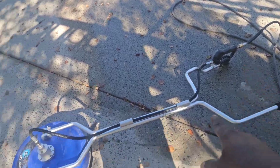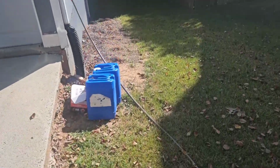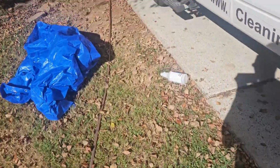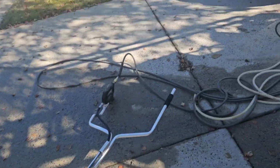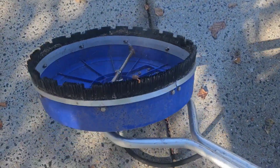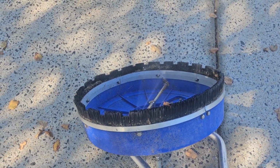I have the pressure line connected to my tool. Let's go ahead and restart the troubleshooting process by, of course, starting with the water source. Let's come over here and hold the trigger. And I don't believe any water is going to come out, because my technician said no water's coming out the first time. Oh, hold up. We got water coming out, but one of the sprayers is not spraying properly. Okay? So it's probably a clog in that sprayer.